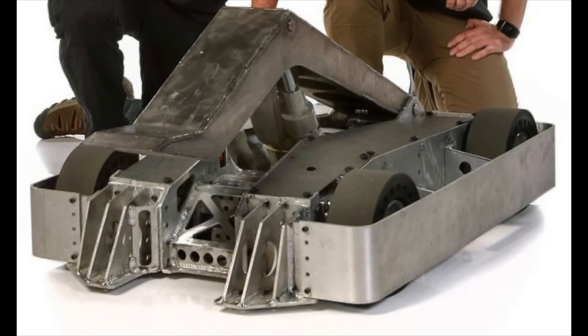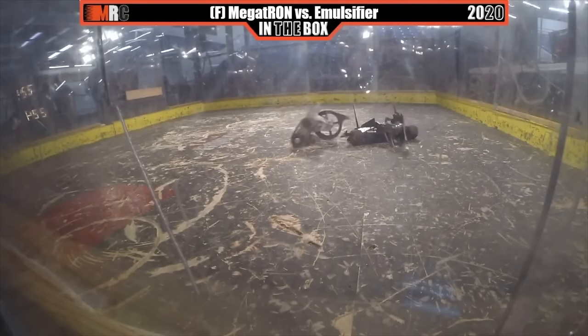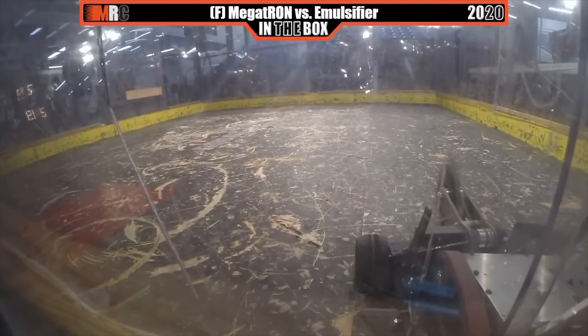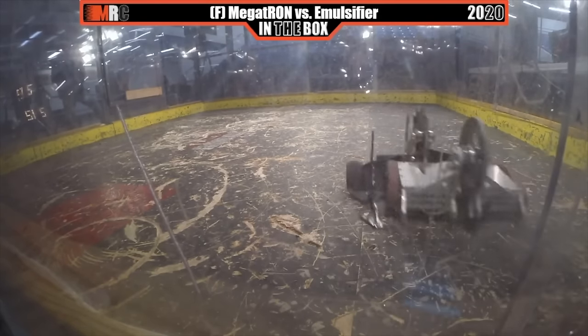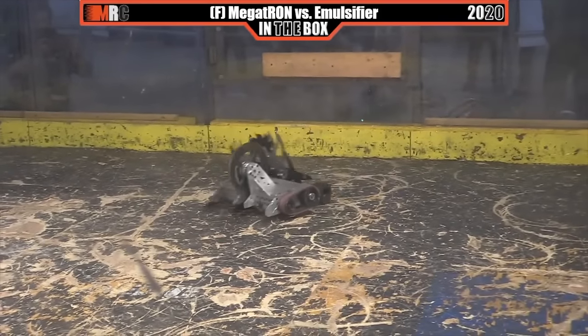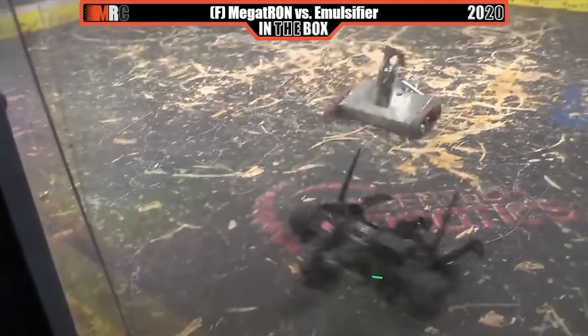Subsequently, most machines armour up in a sort of belt which leaves the top of the robot relatively unprotected. For a long time, top attack robots were simple hammers or saws, but that's begun to not be enough, especially in smaller robots, so the more modern approach mounts a spinning mass on the arm to store large amounts of energy to be delivered in the swing. A small disc can be spun up over the course of a few seconds, whereas the motor powering a hammer has a fraction of that to add energy to the system. The challenge here is having an actuator on the end of a fast-moving arm that needs to survive combat conditions, but there are a few successful examples.